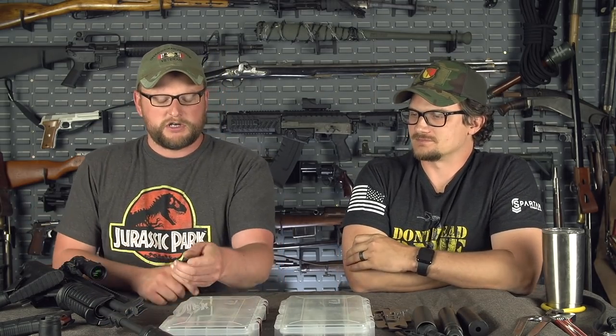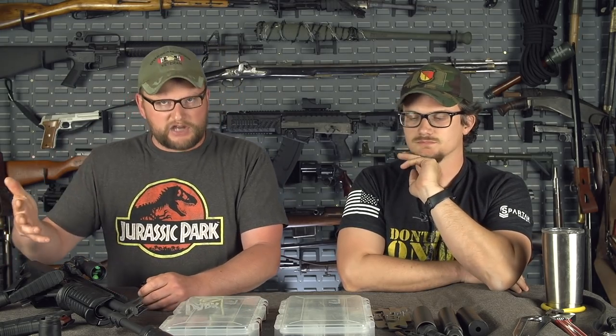Here's a great talking point related to that: tolerance stacking. We ran into a similar issue with this Galil Ace. We pulled the factory device off and went to put on the Rugged 7.62 Surge. We used our Geissele suppressor alignment rod — you need to own at least a 30 and 22 caliber suppressor alignment rod. Geissele does a great job with those — check your bore alignment. Tolerance stacking comes in when the barrel had to be indicated in the lathe and threaded — are the threads concentric to the bore? All those tolerances matter.